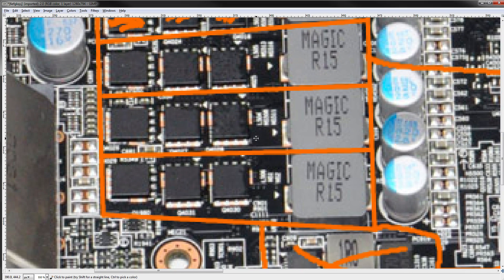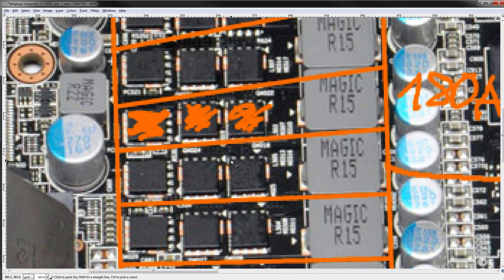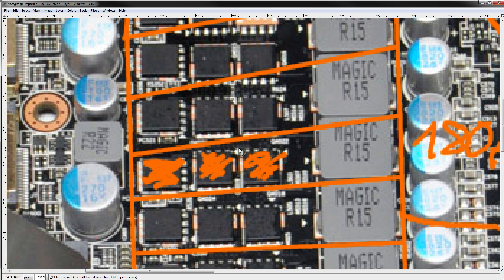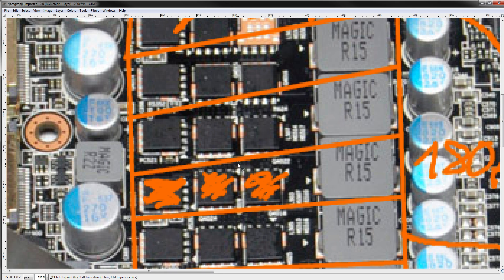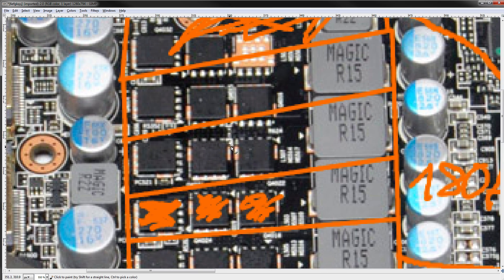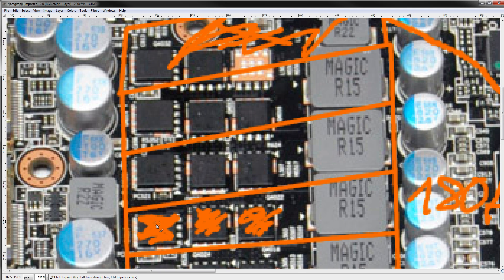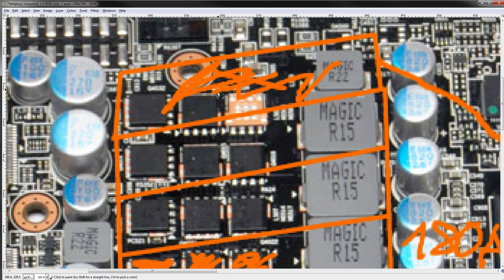It's not really concerning if you're buying the card for gaming, but if you're buying it for extreme overclocking, I wouldn't do it — this PCB is just weaker than all the others. Literally, this is the weakest RX 480 VRM you can get your hands on. In theory it shouldn't blow up, but it's weaker than reference and I don't like that.